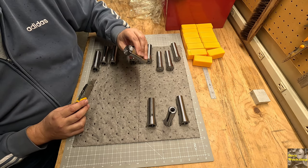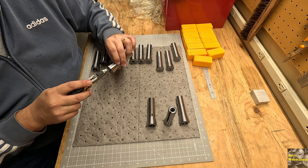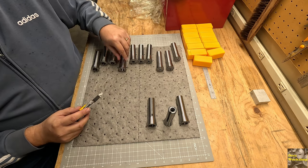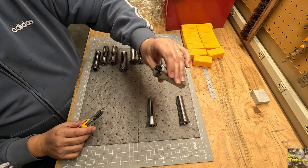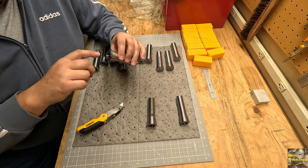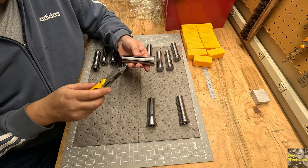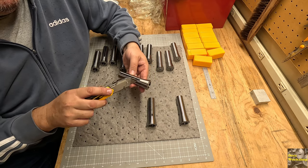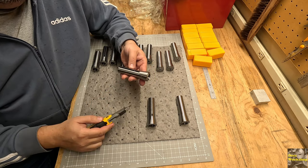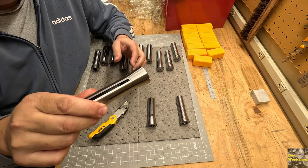This is a half inch. That's going to be a very commonly used collet. So most of them have that as a blemish, but this one has such a large bore, and they got off track on this side and actually cut through the collet. Now, I don't think that's a functional issue. There's a hole in there. I don't think you can see it.